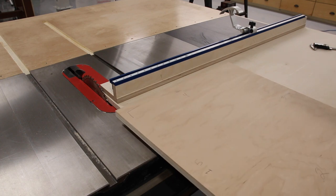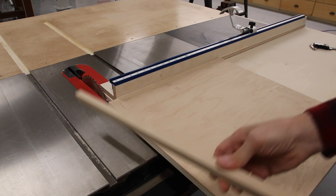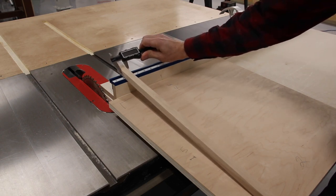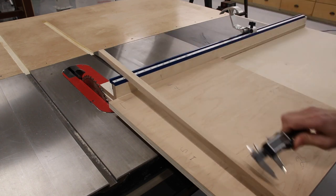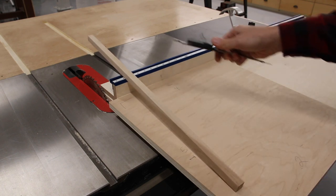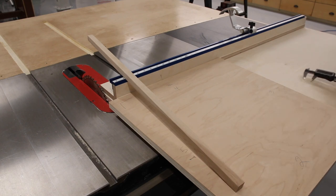And then you make your last cut, number five, and maybe make a cut strip like 1 inch wide or so. So let's pretend this is the cutoff strip that you cut here, and this is how you measure here with your caliper. You measure one end, right? So let's say you got 1 inch and 5 thousandths of an inch, and here you have 1 inch and 25 thousandths of an inch. All right, so you know you're out 20 thousandths of an inch, but in reality you're only out 5 thousandths of an inch. So again, this is what it's called, the five cut method.